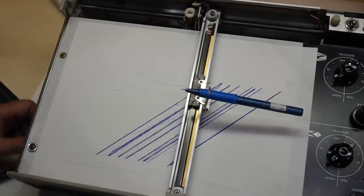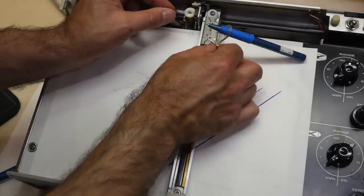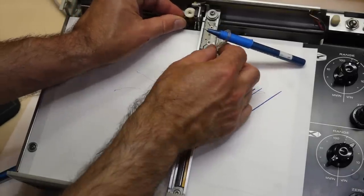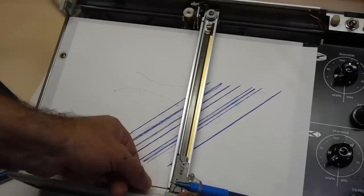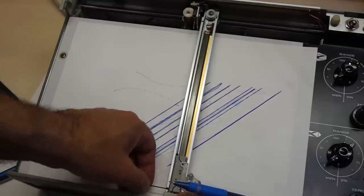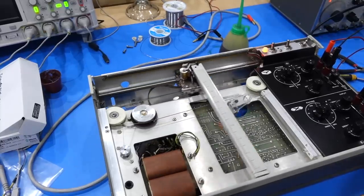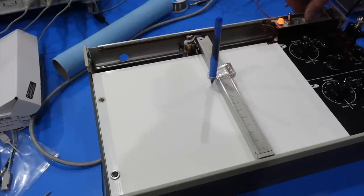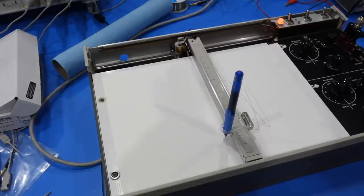And there was yet one more hidden adjustment for the Y-axis ball bearing play. This one is adjustable with a super small hex wrench via 2 access holes at the very top and the very bottom of the slide. Quite tricky, I would have never found it if I didn't have the manual. And I think I have it pretty good when it's not vibrating at all. Very smooth. Pan down. There we go. No more wiggles.